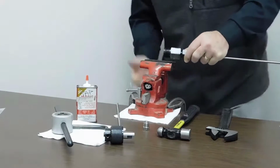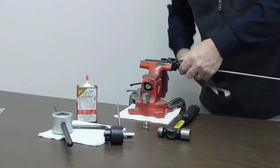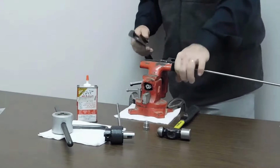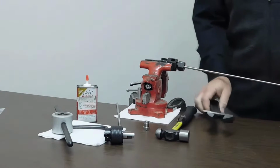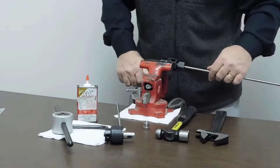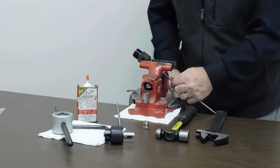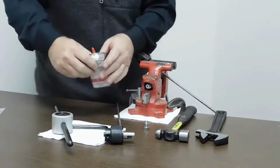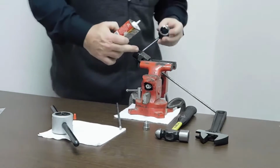We put this in our vise and we tighten the collet nut. Now you don't have to put a lot of torque on this collet nut because it'll squeeze on that tubing pretty good. So I like to do it hand tight and then just a slight snug like that, okay? So our next process now is to stand the coning tool body straight up or even on a little bit of an angle. And what we'll do is put a little bit of lubrication on the blades of the coning tool before we put it inside the tool itself.